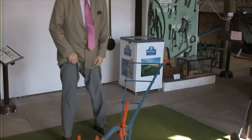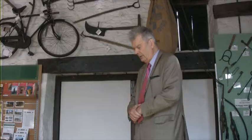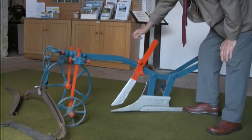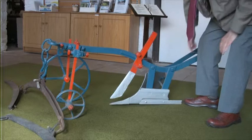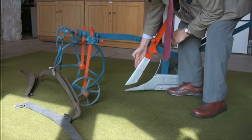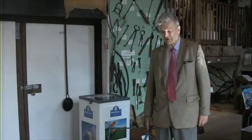Ploughs come in two main sorts. One, like this body here, is called a digger plough and it's used for arable ground. Every action in engineering, there is an equal and opposite reaction. So the action of the mould board turning the furrow must be counterbalanced by the land side here, stopping the plough moving the other way. You have to cut a slice of the soil, so here we have a knife, and this cuts the vertical section of the furrow. The share here cuts the horizontal section of the furrow. This plough turns the furrow one way.